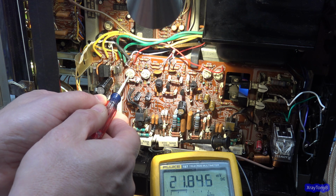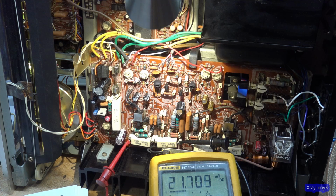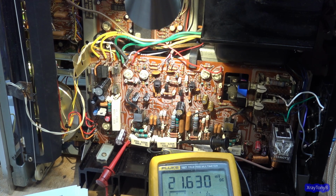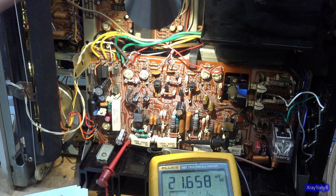And this is going to happen for a good 10 to 15 minutes. Even with that, I still have a current limiting bulb in there, though it's hardly limiting anything at all. I only have 117 volts going into this amplifier instead of 120. And I suppose we can go to direct right now. See, it jumped up a little bit more. Not much, because I was already at 117, now it's at 119, 120, so only 2 or 3 volts difference on the mains. But we're just going to let this sit here and cook.